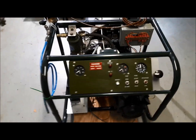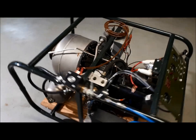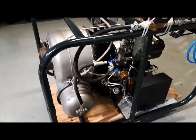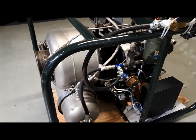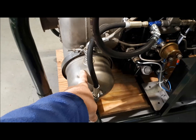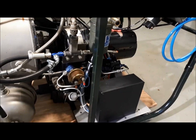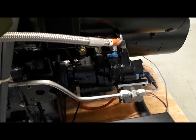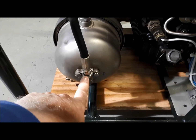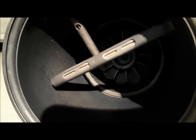Taking a closer look, it's all built into this frame with a control panel for easy operation. It's a very nice little example of a small gas turbine engine — a single shaft unit featuring a centrifugal compressor, a radial inflow turbine, and a can combustor. It's very easy to run; it has electric start. There is the igniter unit, the igniter plug, and the burner at the top of the combustion chamber. We can just see inside and hopefully see the turbine wheel in there.